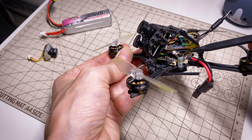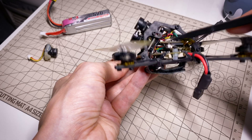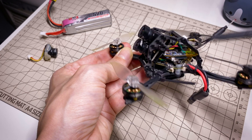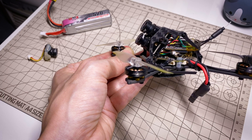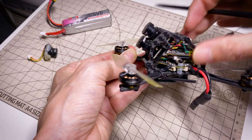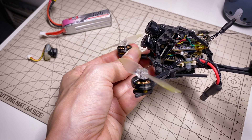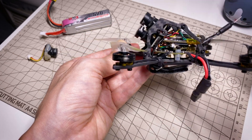On top of that I have the HappyModel VTX — the one without the DVR, just the plain one. The RunCam hybrid board is kind of stuck on top with double-sided foam tape and held in by the frame — it's a 20x20. I originally wanted to mount it on the bottom with the flight controller on top, but that introduced too many issues with the SD card being blocked. I put some Kapton tape on the back to isolate it from the frame, and there's a little XM+ receiver just stuck on top there.